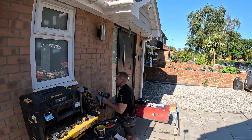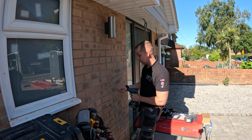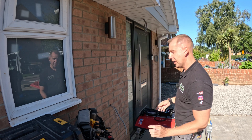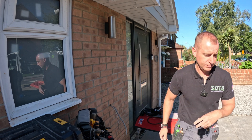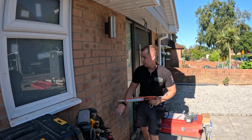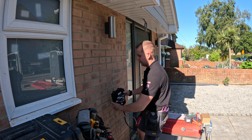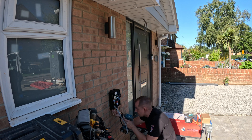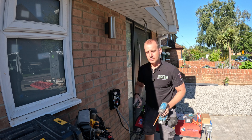Once you've drilled your holes, stick the two screws in the top, then hang the Hypervolt, get the cable in place, and fix it from the bottom. One thing I like to do — which I nearly forgot — is put some sealant around the cable entry hole, which just helps maintain that IP rating, before you hang the charger. Then fix the bottom of the charger to the wall and, once it's nice and level, nip up the top screws. Ready for termination and testing.